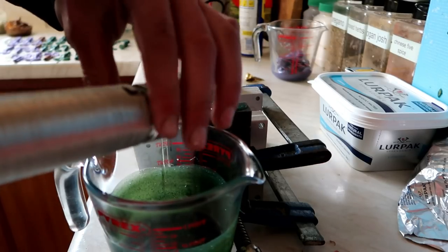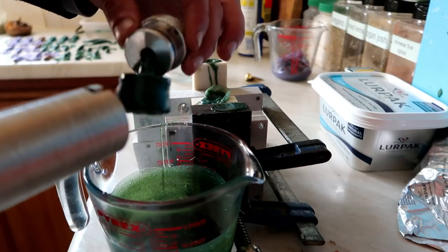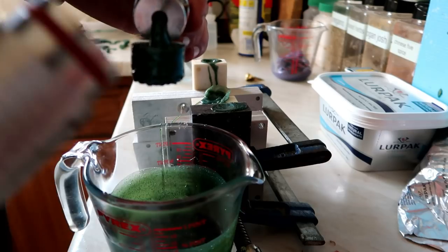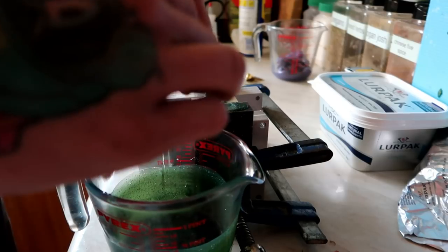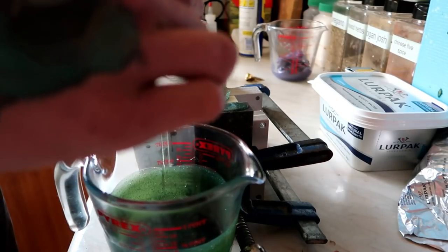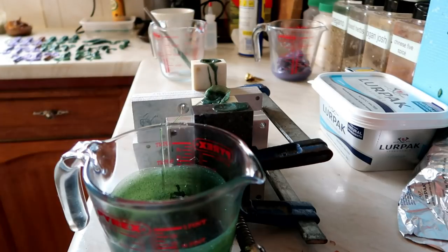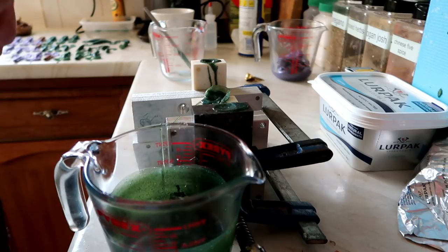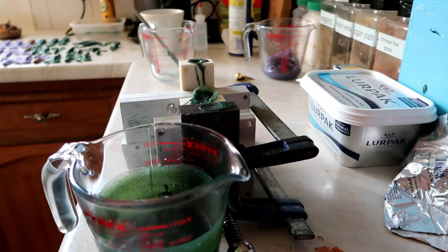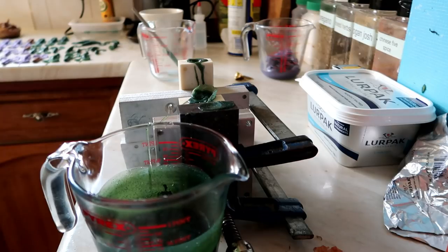To clean the injector, you twist the locking screw sideways so you can get it out and just pull — that's the end of the injector. By now the plastic's cooled enough to touch, it's a bit warm but no sweat. That keeps the injector clean for the next mold. I'll just leave the mold to cool down a second, then show you some of the lures.